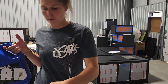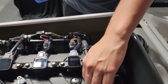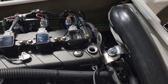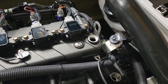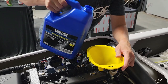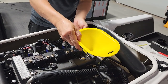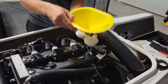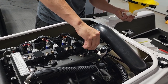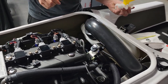For the refilling, I'm going to put about a quart back into the crankcase just so it has some oil on startup. Then we'll put a little bit into the reservoir and check the oil level and top it off as necessary. Take the funnel out, cap back on so you don't forget it and it doesn't get lost, and we will move on to the reservoir.